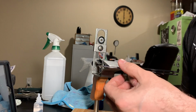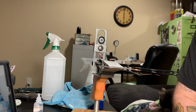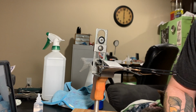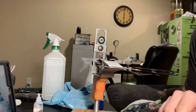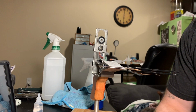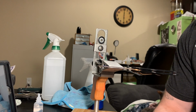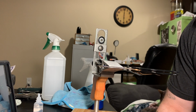All right. No burrs, perfect. So now what we're gonna do is move on to the abrasive film. And I'm gonna go ahead and end the video there, and I'll put that in the second part to keep these video lengths a little bit down so it's not super long to watch. So come back, join me on part 2, and we'll go ahead and do the abrasive films on it, and we'll take it up to 0.1 microns, which is equivalent to 160,000 grit.